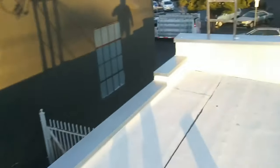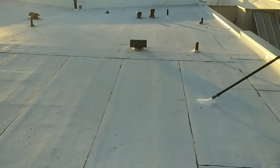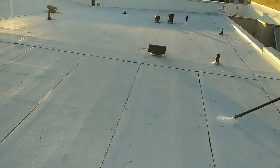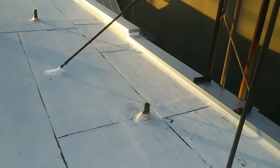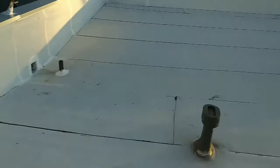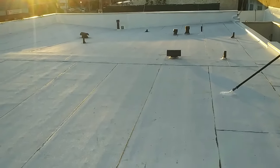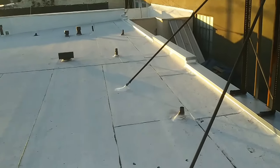Little by little. Alright guys, this is how we finish it. I painted the pipes black because in the summer if someone comes up here and it's really bright, it can bother your eyes — you can barely see, you have to almost close your eyes. By code you're supposed to paint the pipes red or black, any color but white. That's to help the eyes distinguish the stuff on the roof when it's really bright, like at noon in the summer. Thank you, thanks for watching. If you have any questions just call me, leave the comments in this video. If you need more details I can make a better detailed video next time. Thank you!